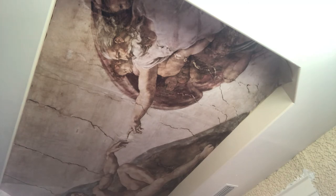So what we're doing is we're just trimming the edges now. I'm satisfied that my mural is in place — which means it's not moving and it's all stretched out. I don't have any more manipulation to do. I'm satisfied that it's neither going to stretch, so I trim it. You want to get the glue off that's underneath these overlaps. There's something called live space on these murals — that's the space that's going to remain. What isn't live gets trimmed off. They call it live and dead — so this is all dead what I'm pulling off right now. Waste. Scrap.